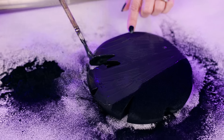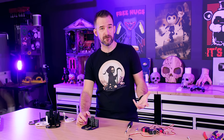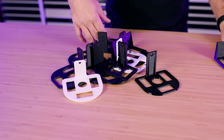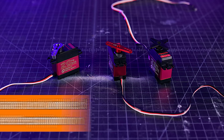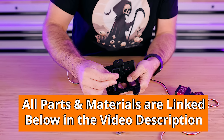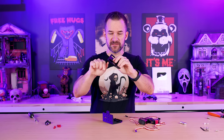The three-axis head mechanism allows us to move Mickey's head around. Jay has been working on this design for a couple of weeks, iterating as he learns — this is the ninth version of one particular piece. But it's finally all working, so let's put it together. First, there are some servos, which are tiny little motors — one for each axis. The servos get screwed onto a servo plate printed out of 3D Fuel's Pro PLA Plus material, which makes it super rigid. If the plate bends and flexes, the mechanism won't work.